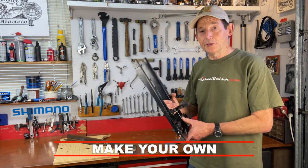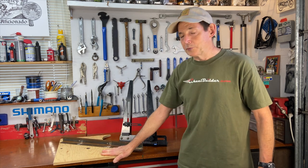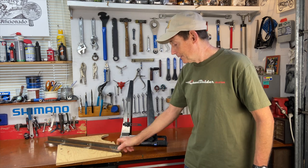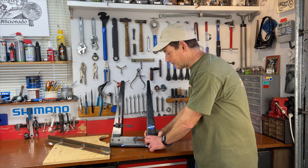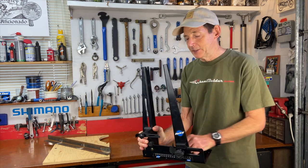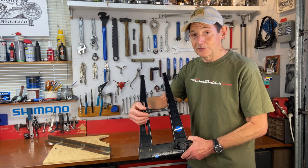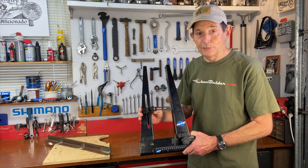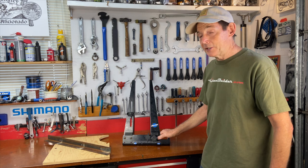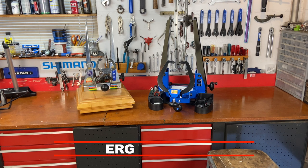When I was showing this stand, some of you were probably thinking you could make your own stand just like that — and you probably could. If you have some steel like angle iron, or good plywood and the tools to work with them, it wouldn't be hard to build a stand. Looking at it, it's pretty simple: a sliding piece to adjust for different hub widths, a slider for different diameter wheels, and an indicator to touch the rim. With some nuts, bolts, and steel or wood, you could put one together.